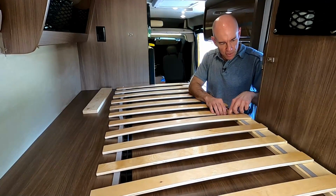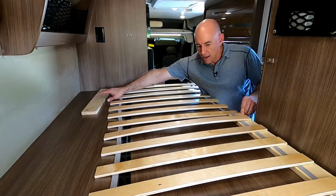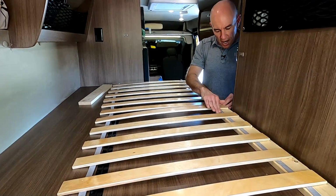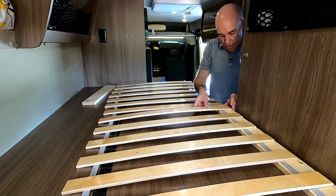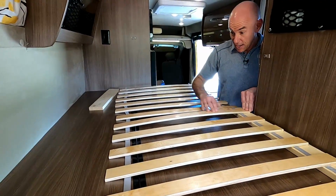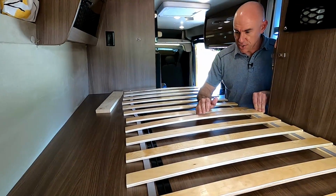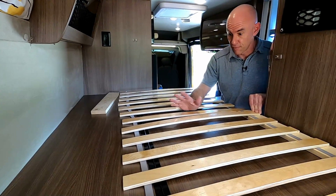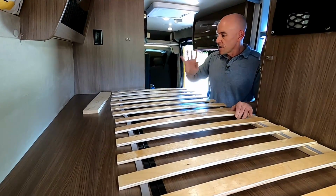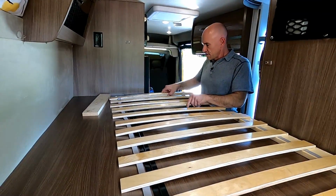So what I think I'm going to do is elevate it on blocks, kind of like I've got this side over here, right? I'll wind up cutting into these blocks a little bit to make a bed for this to rest in, and they won't be this wide either. And then we'll do that. I think I've got some cedar left over from another project, so it's a nice aromatic, decay resistant kind of wood. That'll work out fine.